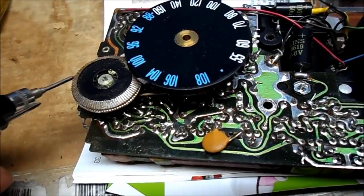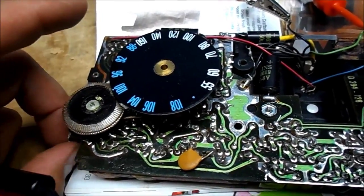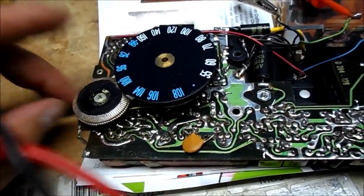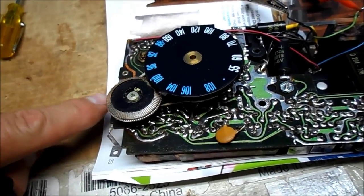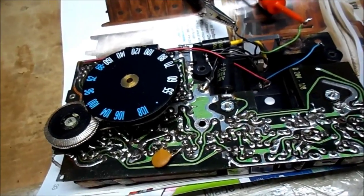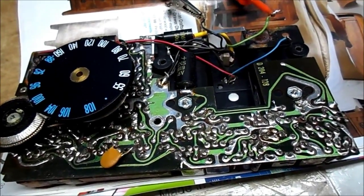I still don't trust this switch, but I've moved it back and forth from AM and FM and tried on each position to try and get some signal. It has three wafers — three sections — so perhaps if one section isn't closed I may not get any signal. But at this point I'm just going to go around and read my voltages.